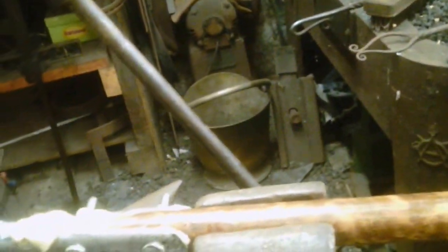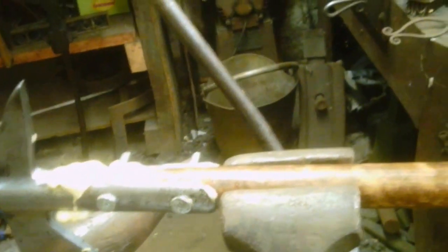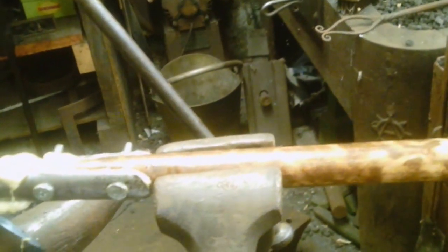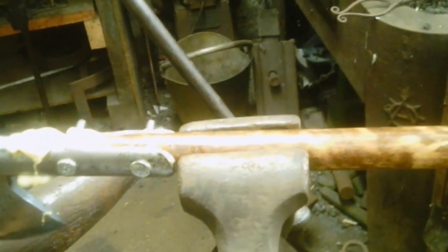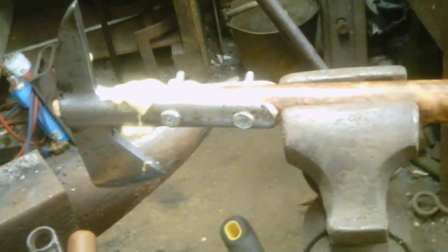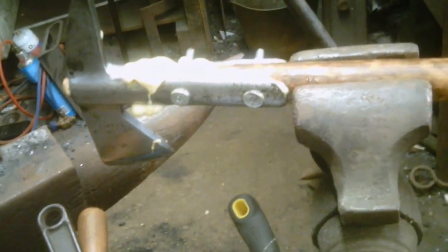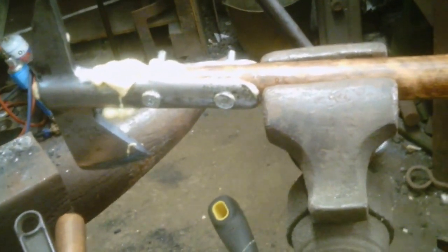Well, there it is. I've changed it. The remains of the handle are over on the drill bench and they're pretty pitiful. That piece of wood there — I know they use beech for these handles, as well as ash. The beech is pretty good wood, pretty straight grain, and this is very straight grain for taking impact. I glued this as well; I've bolted it — not riveted it. I'm going to dress the bolts so they go flat, and that will be it.